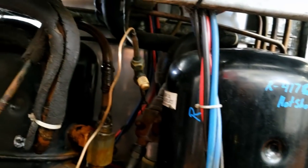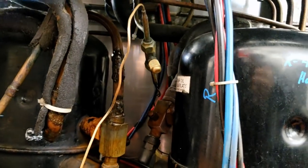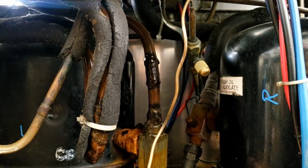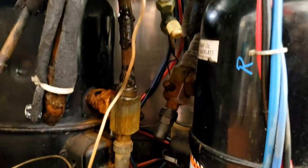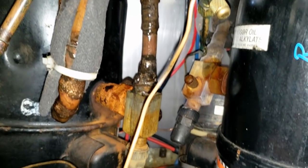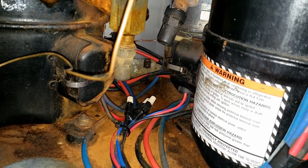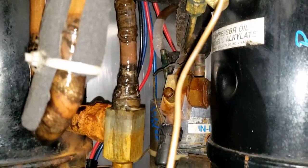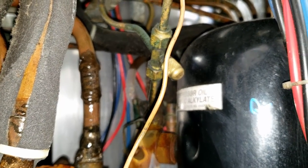Or we can pull the charge — it makes about two pounds if I remember right, but this thing has leaks. You can just see the rough work that's been done on this thing. Part of me says go ahead and pinch it so you don't have to mess with the refrigerant charge, so I think I'm going to do that.